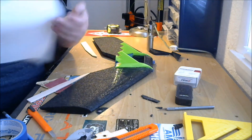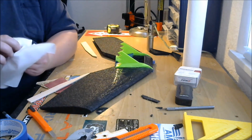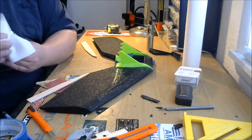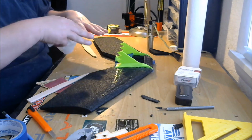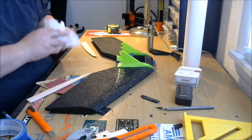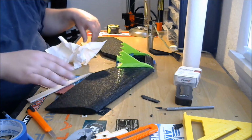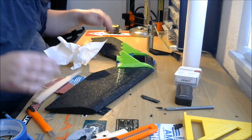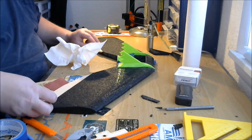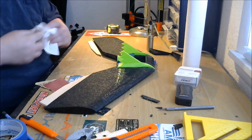So, a few minutes. You'll see me laminating. It'll be a couple hours for me, but I'll pause the video and we'll come back. Like I said, if you wanted to paint, before we laminate, we're going to sand all the foam surfaces, get this scratchiness off, and then we're going to laminate. But if you wanted to paint, you'd sand all the foam surfaces, paint, then laminate. You can paint your Elevons. I'm not going to paint anything. I like it just the way it is. I'm just going to attach them, and we're going to rock and roll just like that. So, alright, I'll see you soon for laminating.